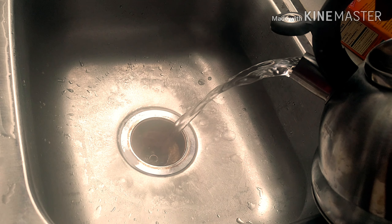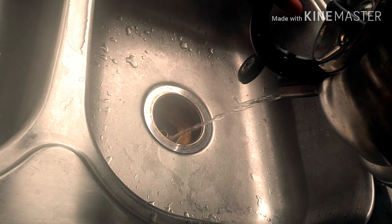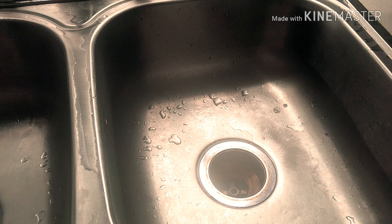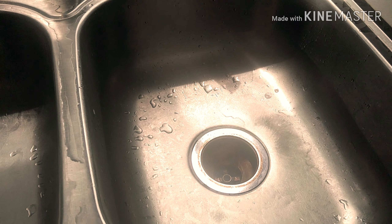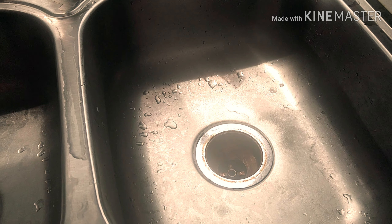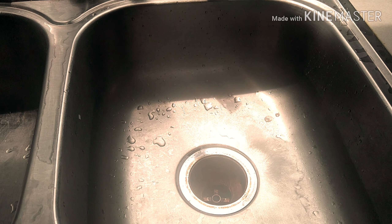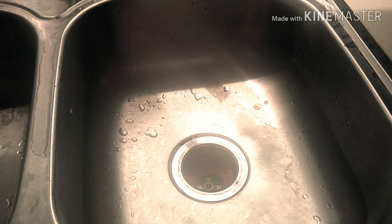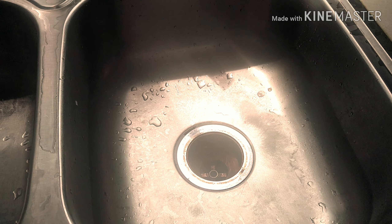I'm putting the whole kettle of water in there — it's not going to hurt the pipe. Make sure that it's boiled, as it helps to soften the grease and everything else, so your kitchen sink doesn't get clogged all the time. This is very cost effective — it costs me less than a dollar. Baking soda costs like 49 cents and I use about one quarter of the package. Vinegar costs 99 cents and I use only one cup. So the total cost is less than a dollar, versus calling a plumber which would be $150 to $200 per trip, plus any additional charges. I encourage everyone to do this method at least once a month so it won't get really bad.